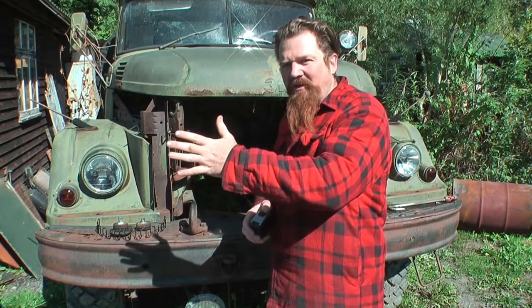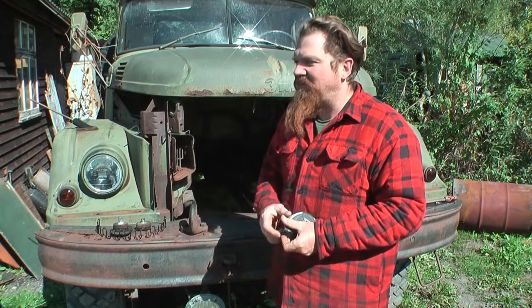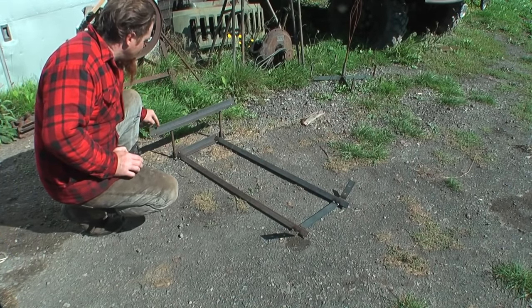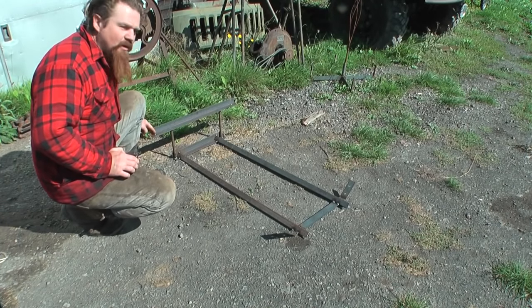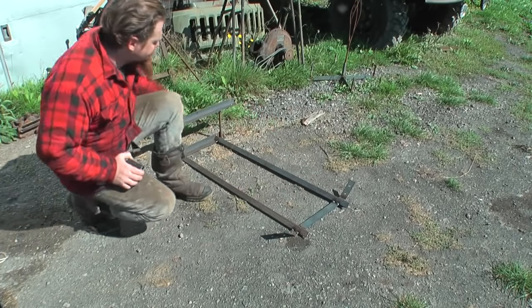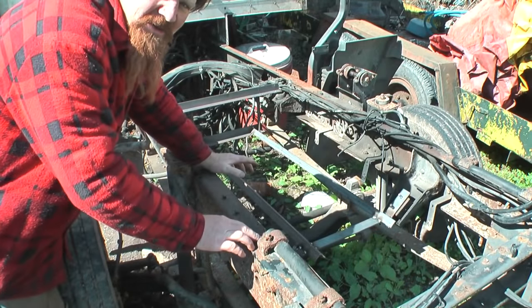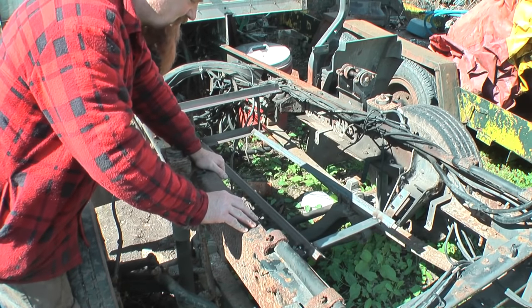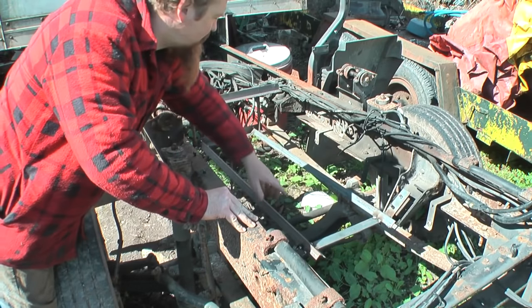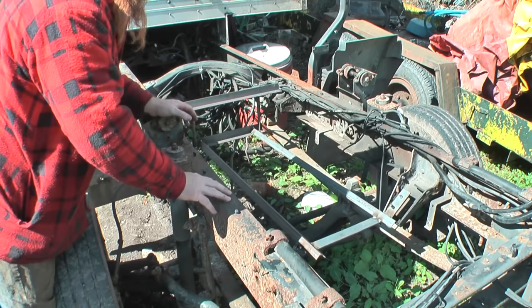So we had a bit of careful measurement of the DAF chassis and came up with this thing made from offcuts mostly that I had lying around. The rear engine mounts, which are on the bell housing of the gearbox actually, are here and the holes are in exactly the right place. These are the front engine mounts — these four holes here at the front. These bars give the distance between them, giving me the dimensions I need to work with the ZIL.